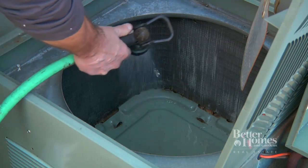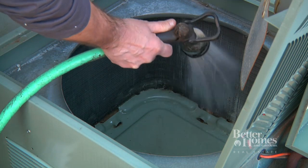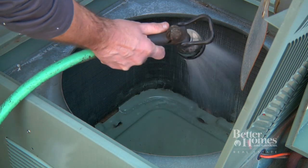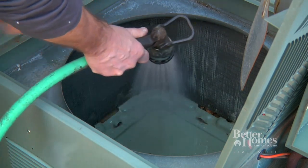Clean the surface of the coil by taking a hose and spray nozzle and start at the top. Push the fuzz and dirt down the face of the coil with the nozzle sharply angled to the coil. Spray all the way down and around until it's clean. Even if there's no visible dirt, it's still a good idea to clean the outside coil once a year — spray with a mild detergent mixture, let it sit for about an hour, then go back and rinse it thoroughly.